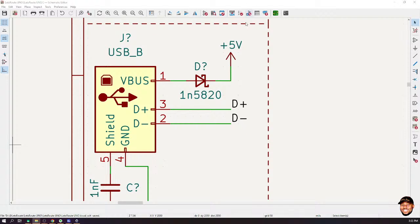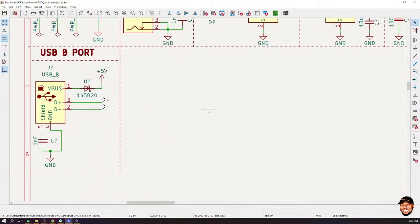All right. If you look on the Arduino board, they also have a way of doing it using a comparator. Before I talk about that, let me explain what a comparator does. A comparator is an IC, a special type of op-amp, operational amplifier. That's the reason I didn't want to talk about them. As their name implies, they compare two voltages and select one or perform an action based on the result.